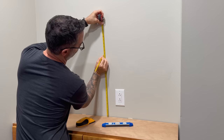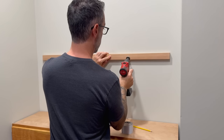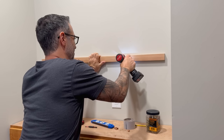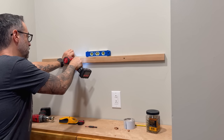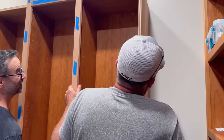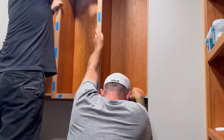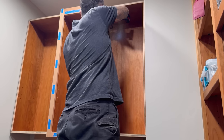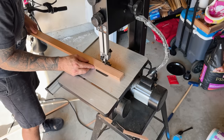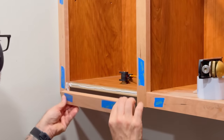Now we head back to the house to hang the upper case. Anytime I hang a cabinet, I like to employ a wall cleat if possible. I'm often working alone or with minimal assistance, so it's nice to have something to set the cabinet on to take the weight while also keeping it level and at the correct height. Because there's no reason a cleat can't be permanent and decorative, I'm leaving this one right there. Every time I do something like this I'm always super nervous it's not going to fit. Now I'll scribe the stiles, cut at the bandsaw, finesse, and install. With the outer stiles in place, I can cut the remaining rails to size and install. There's a little unevenness between the face frame pieces so I sand everything smooth, and when I break the edges with backside sandpaper I use the vac at the same time to limit dust getting into Nicole's clothes already in the closet. Now for some finish on the face frame.